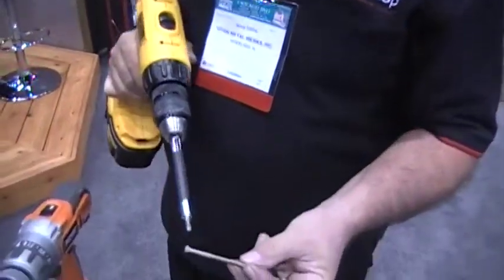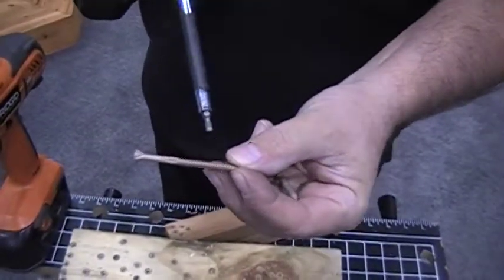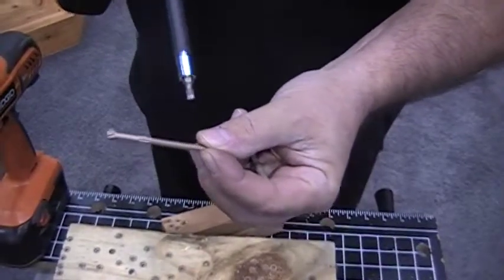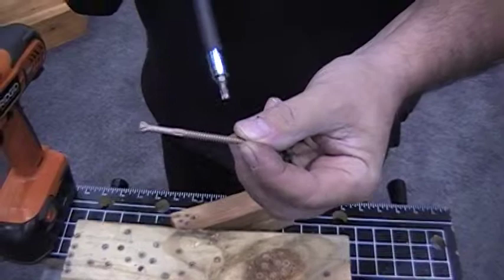This is a split-stop wood screw. You'll notice right away it's a little bit different than most wood screws you use in the field because it's got a very fine thread. It has a fine thread, but it has more threads per inch. So you get greater withdrawal resistance with this screw than you do a coarse thread screw.